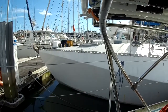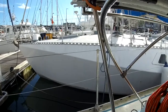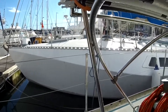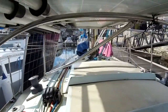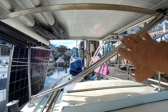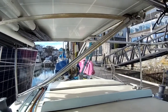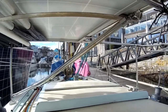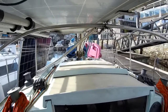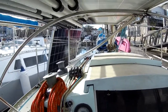The rear uprights aren't upright, they're sloping forwards. The front ones are upright, so we're starting to create a triangle, and that made it stiff. And then we've got this diagonal crossbar, which is here, and we've got another one to put in. We've taken that out when we took the panel off, but we'll put that back in. So we've got two diagonal crossbars, we've got the rear bars sloping inwards, so there's quite a bit of triangulation going on, and makes it really rigid.